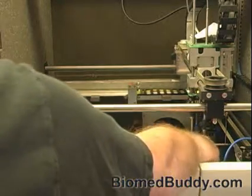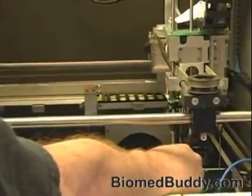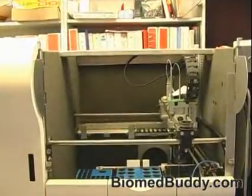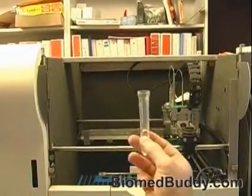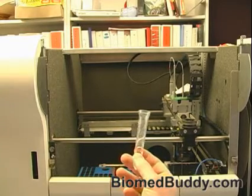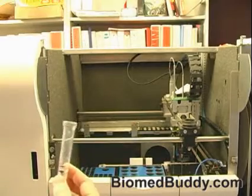Here's 20 pulses. I'm going to put my little vial over needle number one, hit enter, and what I'm looking for is that the solution should fall between the two lines — 3 ml is the bottom line, 4 ml is the top. That tells me my Valco pump is working. I don't particularly care if it's a little high — it just means it's cleaning a little better, though an operator might complain it uses too much cleaning solution. Bottom line: between 3 and 4 ml is spec for 20 pulses. I now know my Valco pump is adjusted and proper.